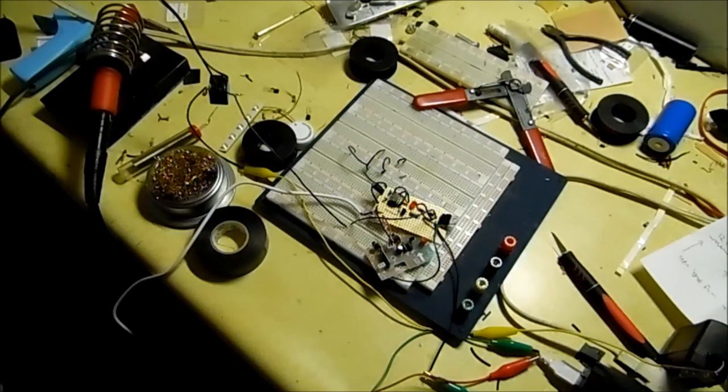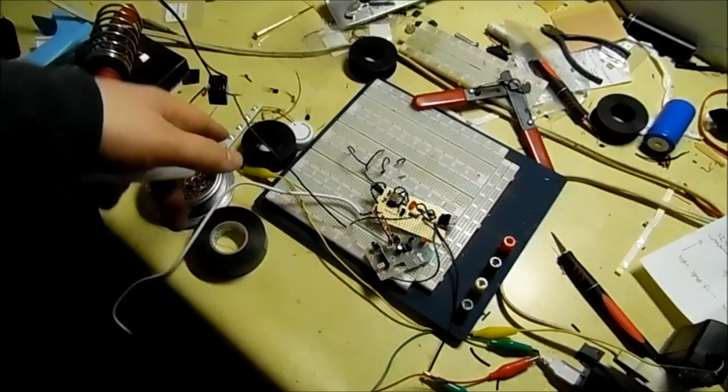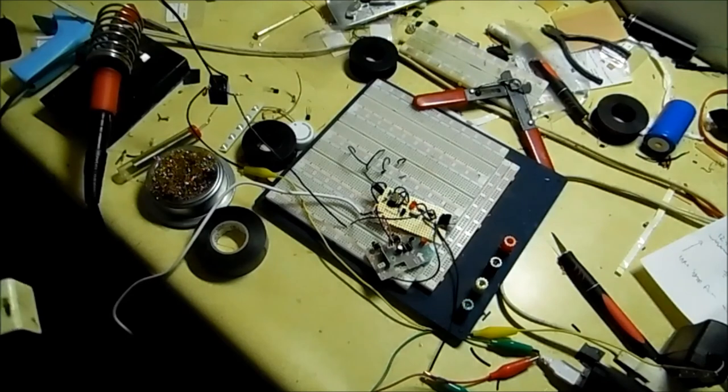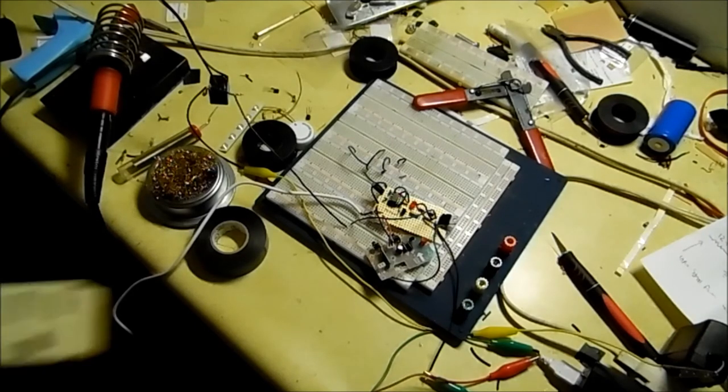The AC mains approach seems a lot more promising. There was another possible issue — the adapter I was using for the relay power supply; I changed to a 12-volt wall wart instead of the 9-volt that was reading 14 volts, which could have also been an issue. After the 30-second monostable output, the light turned back on. I'm going to finish wiring this up nicer, tap into the power strip to solder some connections, and move forward. In electronics, as in any field, you have to expect roadblocks.